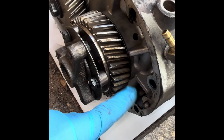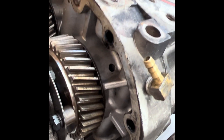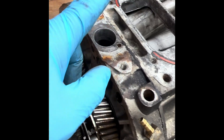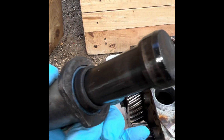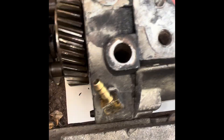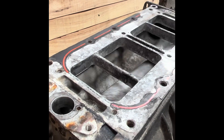Ideally you don't want to use a bypass end plate on a hot rod conversion, even though they're strong, webbed, and have the gussets and large bearings in the V92 stuff. You sort of want to replace that, but if you can't, you can block off that bypass outlet by tapping in a Welsh plug or some type of plug — even a tube, like a sleeve that mimics the factory thing that can get tapped in to seal it off. But you're still going to have a slot on the end plate on the internal side, and air and fuel is going to get sucked out of that slot as the blower is working. So you're going to lose a little bit of efficiency and some boost, but this thing is still going to flow power — you're still going to pump 600 to 900 horsepower worth of flow out of these blowers.